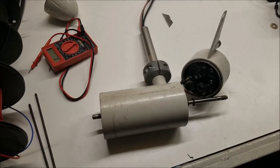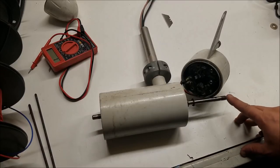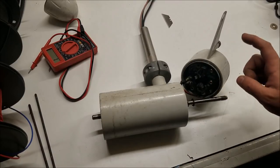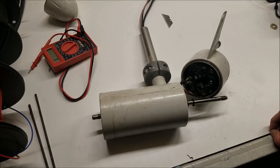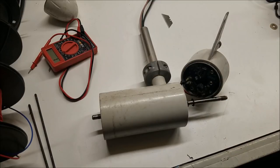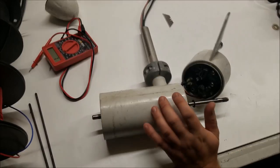I was looking at the Sea Spy motor - the only one I have. The motor itself, there's probably nothing wrong with it. The brushes work, the motor spins, I cleaned up the armature. In theory, this is probably fine. What doesn't work is the built-in electronic speed controller. My epiphany: remove the ESC, hook up the brushes straight to some wires coming out, and worry about a speed controller elsewhere. That'll save me quite a bit of money and give me a better motor.